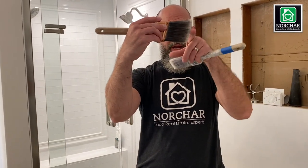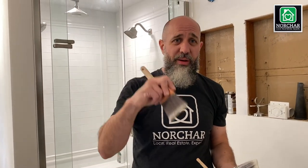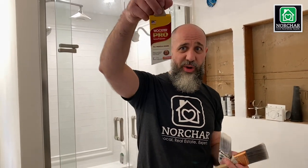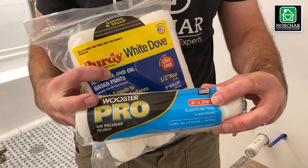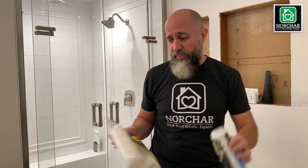I suggest an angled brush — two and a half inches wide. That's the size I've had the most success with; it holds the right amount of paint. I also have a modified one with the handle cut off for tight places. If you feel you won't be precise, go with a two-inch brush — smaller is easier to learn with. For rollers, for most interior painting use somewhere between a three-eighth-inch nap and a half-inch nap — bigger nap creates more texture.